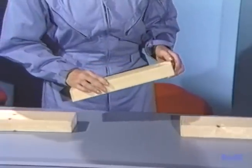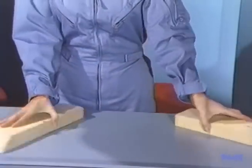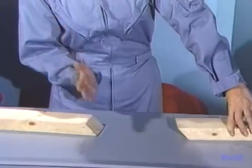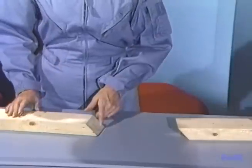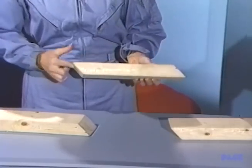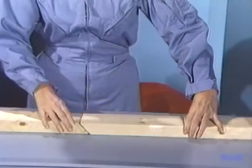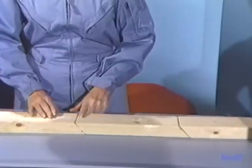We can do it with straight-cut butt joints or better still with bevel cuts. The problem with straight cuts is that when you solder the first end, then come over to the other one and put your iron down, it sends heat back to the first joint, melts it, and it pops up on you. Also, the bevel cut gives you greater solder joint surface area. The trick is to use bevel cuts — angle the blade so when you cut out the damaged piece, you leave an undercut on one conductor end and an overcut on the other. Then you take your replacement piece and bevel-cut its ends so they lock in with the overcut on one end and the undercut on the other. When you go to solder one end, the other is locked under there and can't spring up.